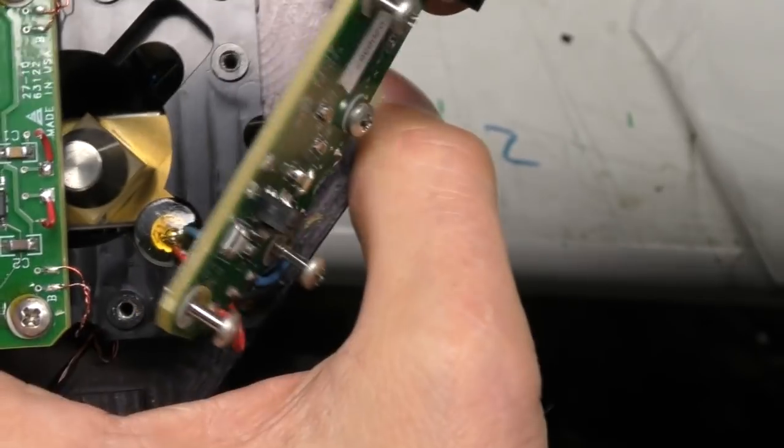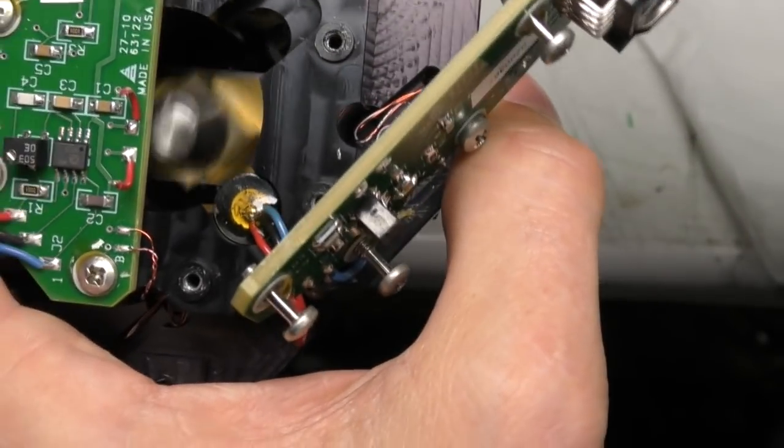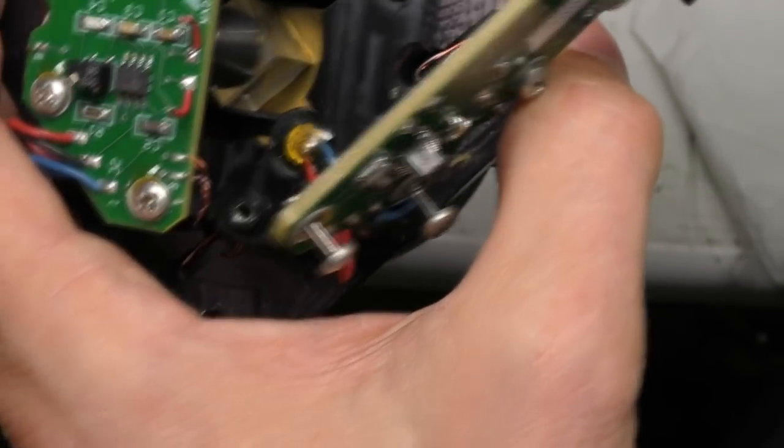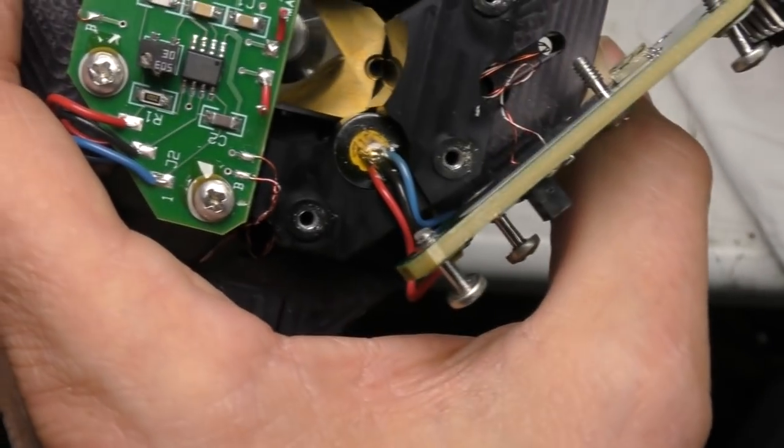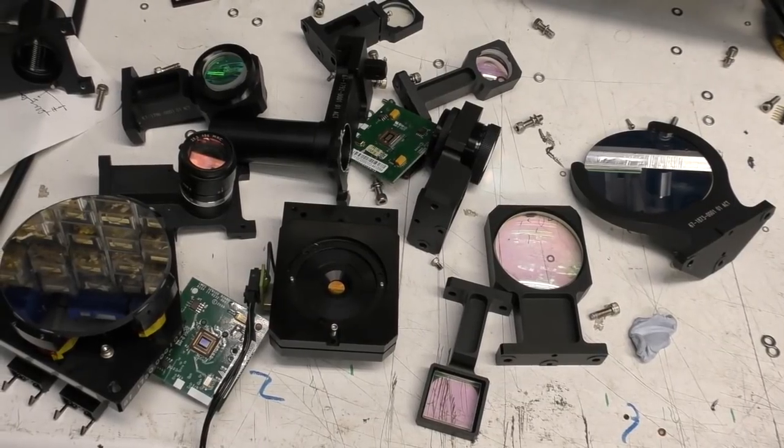So yeah, optical sensing obviously makes sense for this because you don't have any mechanical drag, but that seems quite a complicated arrangement, which is presumably done for accuracy and maybe speed. So we've got an awful lot of optics there for what is basically a sort of image find and focus type application. I can't help thinking that if you did this today, you could probably just use a high resolution image sensor and throw a bit of processing at it just to take a large high res image and actually pick the details out of it. Maybe something like a liquid lens autofocus or even a mechanical autofocus. The dates in this look like about 2010 manufacturing date, so yeah, the design may be older than that.